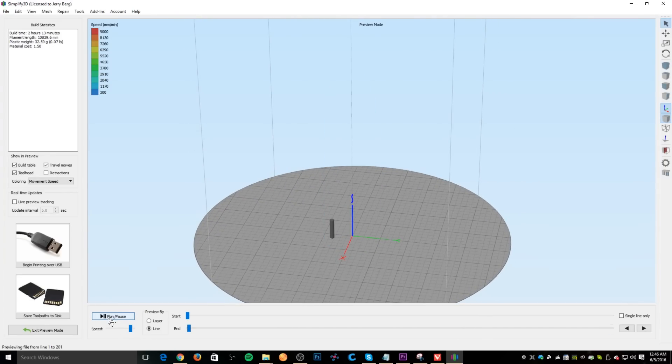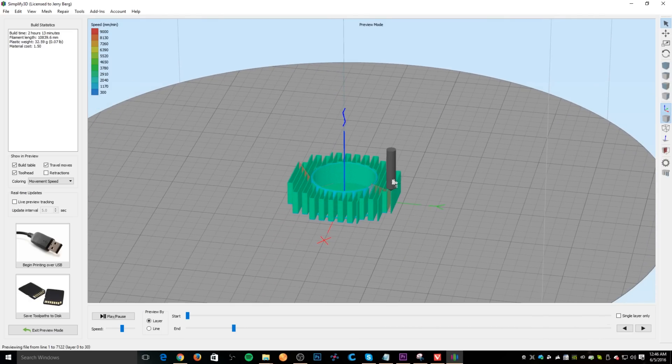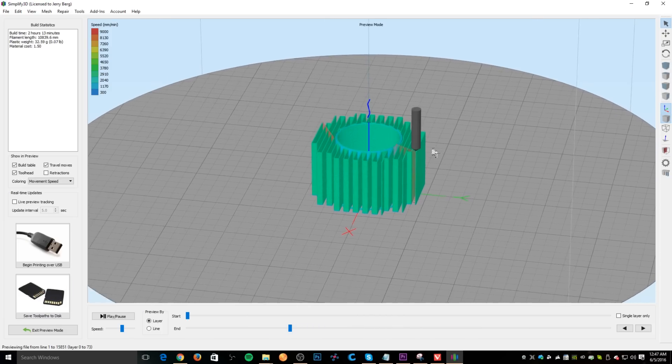Now I'll click Prepare to Print and a new UI opens up showing a chart of print speed per layer. You can see the support material below is a nice zigzag pattern that tears away very easily — I really love how this handles support material. If you push the play button, it shows you in real time how the printer is going to print your object. You can click By Layer and see exactly how everything builds up — it's going to be a hollow object. You can even slow it down to watch layer by layer. Now all we do is get this over to the 3D printer.